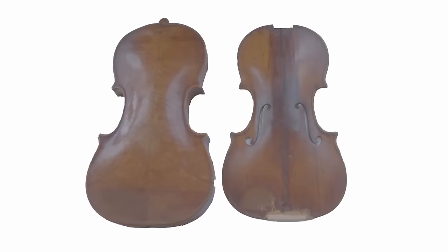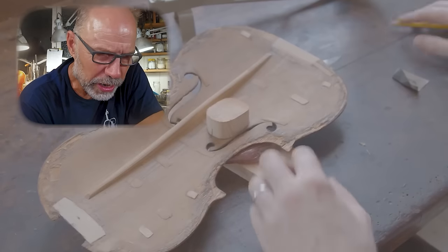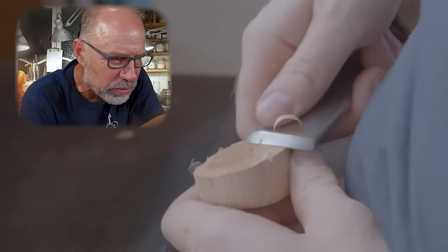So it's definitely an older violin, could be 1840s. I can't exactly tell where the violin is made. The first thing he does is fit a soundpost patch. It looks like they've already fitted patches where the top and bottom blocks are, and they're currently doing the soundpost patch. That's done in a fairly standard way. I would probably put some guides in so that the soundpost patch goes in the same way every time — you can have a much more accurate fit — but that's definitely the correct way to do a soundpost patch.